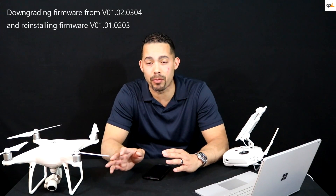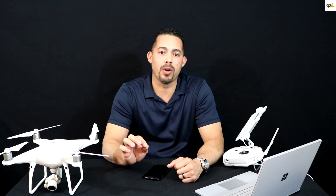Most of the issues I found out were from firmware. I spent a lot of hours today trying to figure out a way to fix this firmware issue. I decided I'm going to try rolling back this firmware. I was on the phone for about two hours with a friend of mine in Atlanta — he was having the same problems I was having with my Phantom 4 Pro. We both at the same time reverted back our software on DJI Assistant 2, and lo and behold it's actually working like it's supposed to. I think I'm going to keep mine with the old firmware, because that current firmware is literally flawed.